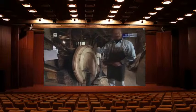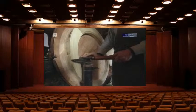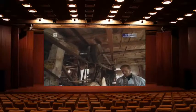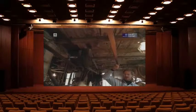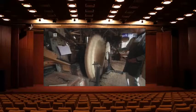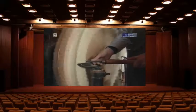Dave explains: you can see that we've screwed the raw frame onto the face plate of this elliptical lathe and we have a tool rest right here at exactly the right height so that when you put your cutting tool here you can cut an ellipse into your frame. The mill still has the old pulleys and belts to drive this equipment — it was originally water driven and for a while driven by a steam engine as well. When the pulley slides onto the drive it swings way out of balance on one side, but over at the tool rest you can actually cut the shape into it and your tool is cutting an ellipse into the frame as you hold it still.